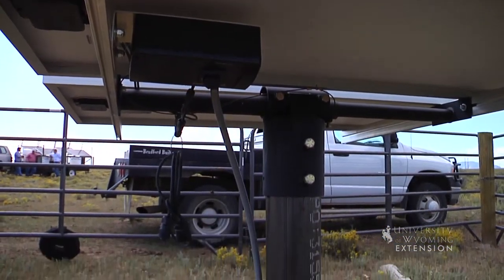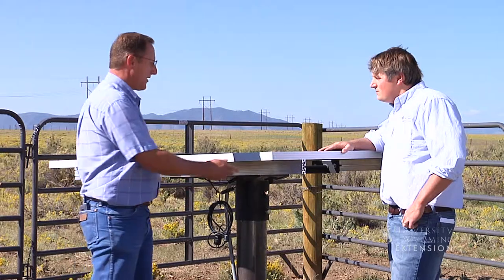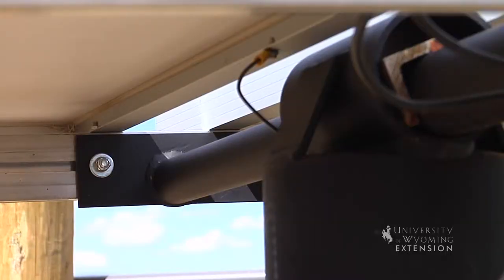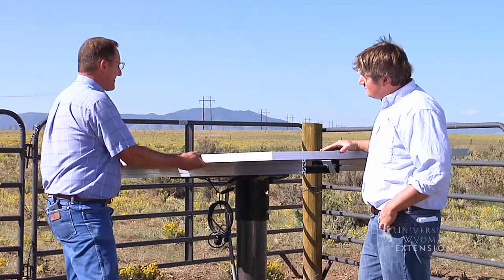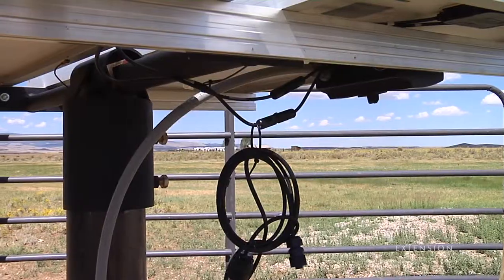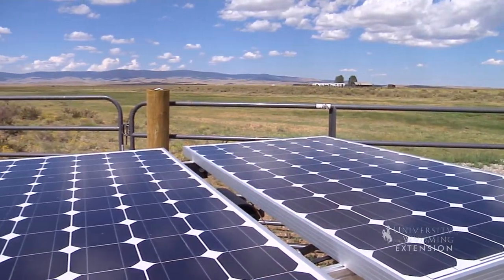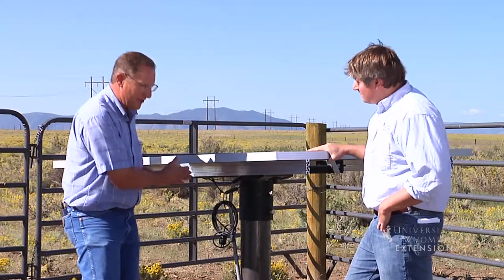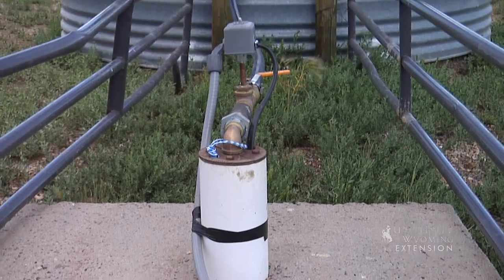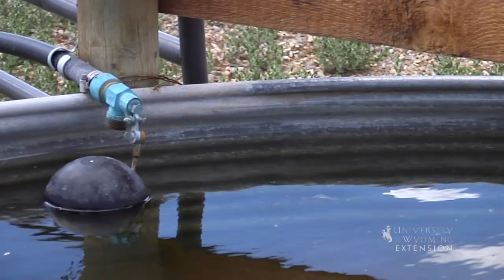You do want to have a proper base. We use a 6-inch steel pipe here, and we have a pipe welded on the bottom and cemented in, so there's no way the wind can turn any of this system around. You want to make sure you have a substantial rack holder to hold these systems so they don't budge — the wind doesn't tear them up, critters can't tear it off. It's very important if you're going to spend the money on the panels, you want to make sure they stay where you want them. Then once you have all your electricity hooked up, your panel arrays wired together, put everything in the conduit, and make sure you get your float set up right so you're not wasting water — when it gets up to the overflow, it shuts everything off.